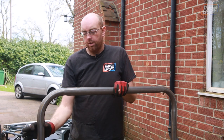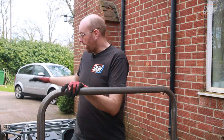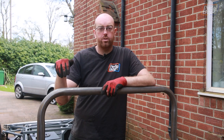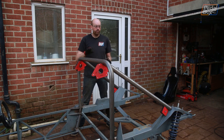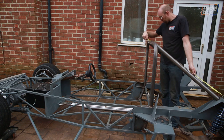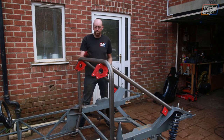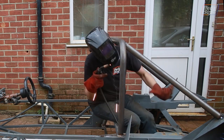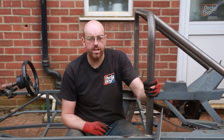To position the rear braces coming off the main hoop, we have a few options — at the bottom, middle, or top of the bend. We're going to position it at the very top of the curve. Since we're going to have a windscreen that comes up to the top here, we do need something from the edge of the windscreen onto this hoop, so we'll cut a couple of pieces and fit them onto the hoop and down onto the turret. The rear stays have been cut and they fit onto the back of the main hoop really nicely. I've squared them up from the front and back of the car to make sure they're exactly symmetrical — they fit nicely and do square up, so we're going to get these tacked in, check them all for square again, and then weld them in properly.